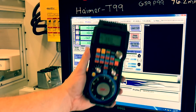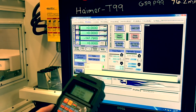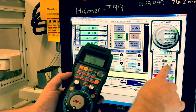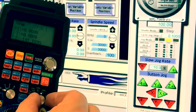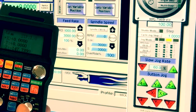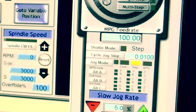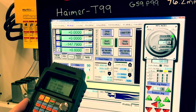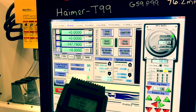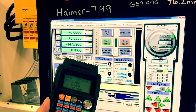But I bought this XHC MPG pendant, and overall a lot of it works really good. Hit Tab — you can see right now it's on step mode, but if you hit continuous it goes to continuous; step goes to step. When you change the settings on the dials for the step increment it changes accordingly: 1.0, 0.1, 0.01, 0.001 — you'd never use that in metric, but still. So 0.01 is about five tenths for Imperial guys — half a thou — and then you can select X, Y, and Z right here. Here's my problem: when you start to jog this thing, it's not accurate.